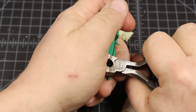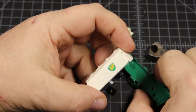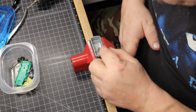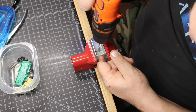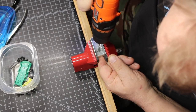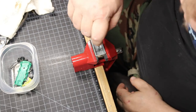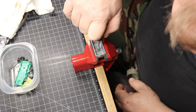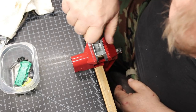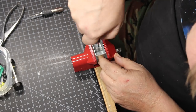Right now I'm in destruct mode. This casting looked really good — no bends, no scuffs, just chipped up paint from heavy plate. There was really only one post that needed to be drilled and tapped. I get asked this a lot: it's a 1/16th inch drill bit and a 2-56 tap with a 2-56 button screw. Use a little bit of oil and be patient with both the drilling and tapping. If you feel the tap starting to tighten up, back out a little bit and then start tapping again. Same thing with the screw.